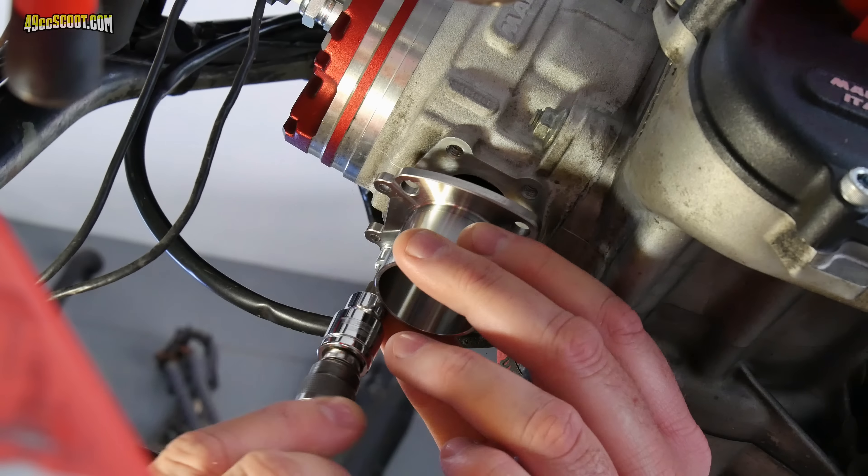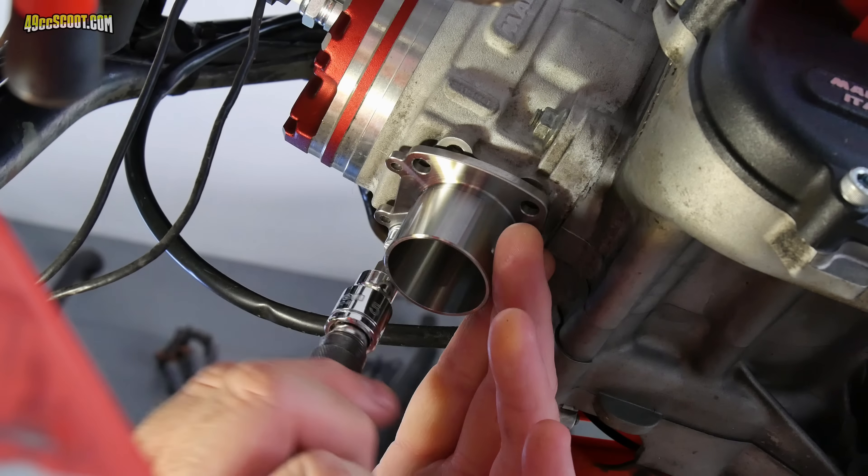Another thought was to get a chunk of steel rod, machine it to the appropriate outside diameter, and bore it as large as I could on the mini-lathe before welding it to a flange cut from probably 1/8-inch or 3/16-inch steel, and then hand-porting it. With material cost and the amount of effort involved, it may just be worth buying the flange and cutting the OD down. I decided that if the pipe turned out to work well, then maybe it would be worth figuring out a better flange, but not before some testing.